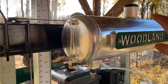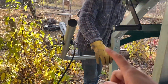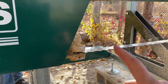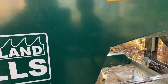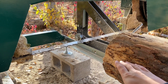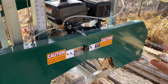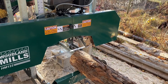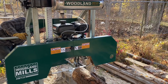This water reservoir — the line runs down, and when Derek presses the throttle it activates where the water comes out of, which is a little bib-it hose there. That's where the hose ends up coming out of, and it runs onto the blade so as it cuts it lubricates. This is a pretty dry log, but for any sappy logs you just don't want to risk snapping a blade from too much strain, so that's why you need lubrication in that water reservoir.